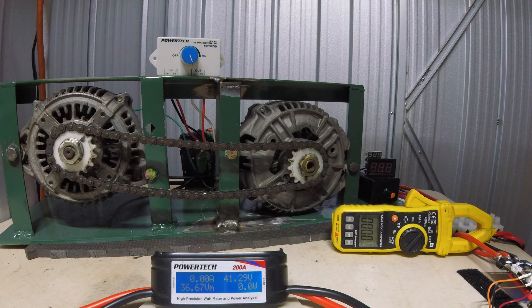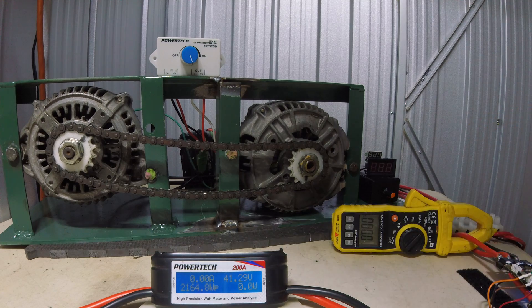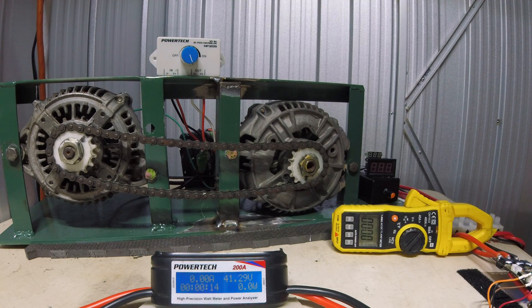I've been doing some more testing with bigger ESCs, which should hopefully max out these motors and the load bench. This is the load test with no cooling. I'm going to take it to about 50 amps and just let it run until it overheats, then find a sweet spot where it'll run at the highest amount with no cooling. Let's give it a go.